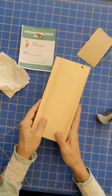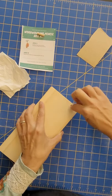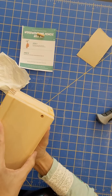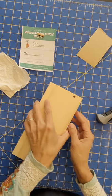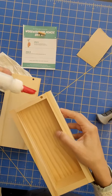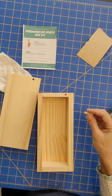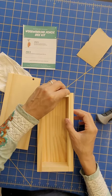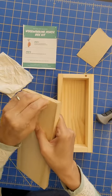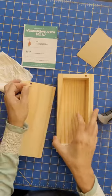So now the top is gonna line up with that hole here. You can put your eyeball right here and check that out — make sure that those holes are lining up. What we need to do is just put a couple of drops, not a lot of glue. If you put too much glue in the hole, there won't be room for your dowel. So you can test out your dowel and see if your dowel might need a little sanding. It looks like my dowel is a little tight, so it feels okay in this hole but I think it might need a little sanding.